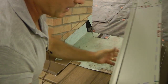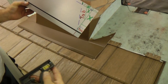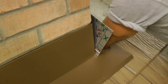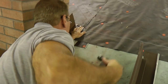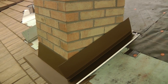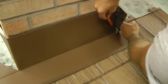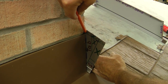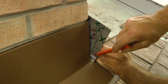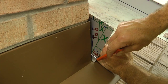As you can see, I have already marked a piece. I have my one-inch point right there that's going to extend beyond the chimney, and I'm going to make sure that gives me the one inch I want. I'm going to come to the upslope side of the piece and temporarily nail it in place. That will allow me to take a pencil or marker and mark the bend line that's going to come around the front of the chimney. This tab right here will wrap around the front, this tab will wrap down around the unpainted metal, and the top half inch or so will wrap underneath to hold it in place.